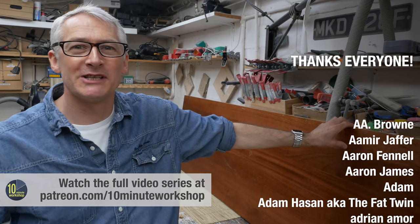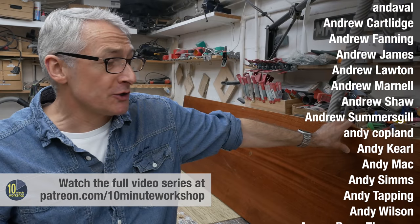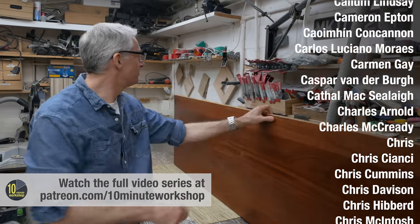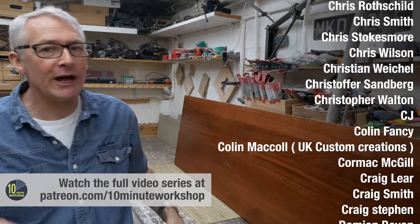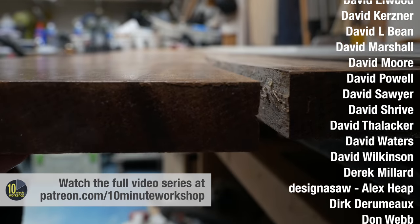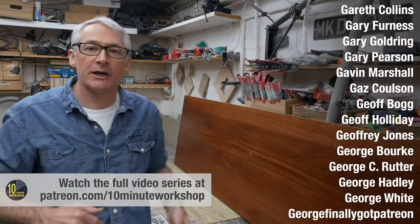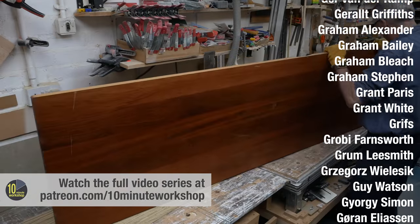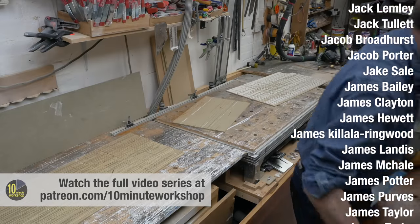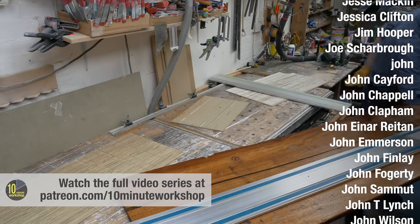My neighbour picked up a couple of old lab benches from a school on eBay — they're teak and he wants me to turn them into a tabletop. This one is in pretty decent shape, though one edge is particularly poor with a huge split down it that I can't repair. So we're going to have a slightly offset join: one side will be about 600mm, the other a little over 300mm, to make a 900mm wide by two-and-a-half metre tabletop. It's always a challenge moving larger boards around a workshop this size, especially when trying not to make the split in the smaller board any worse.